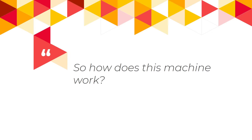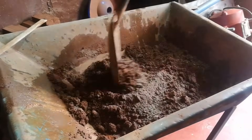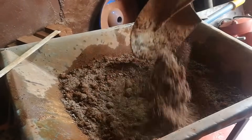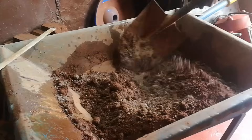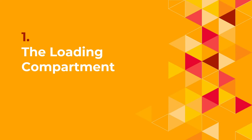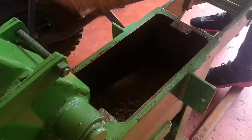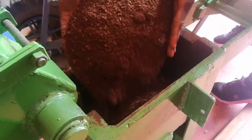Now if you're going to invest in this machine, you need to know how it works. Once you add and properly mix a stabilizer such as cement and water into the soil, it's time for it to be compressed. Let's look at two design features of the manual interlocking soil block machine. The first design feature is the loading compartment — this is where the soil is loaded into the machine, and it acts as a mold that will shape the final interlocking soil block.